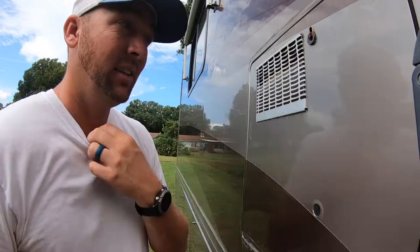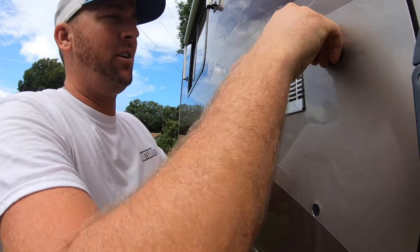We're gonna head outside and pop out that anode and the plug and drain the tank. I'm gonna open the valve inside here to the water. This will let off any pressure that's in the system. Essentially, it'll be a vent to drain the tank so it has a way for the air to come in. Let's pop in here to our water heater and drain the sucker.